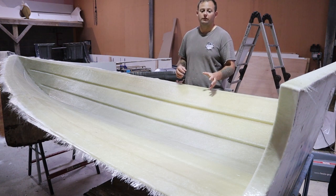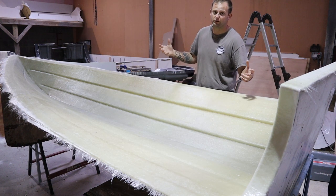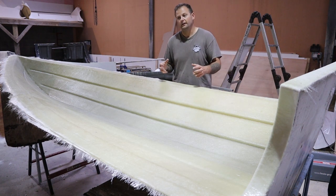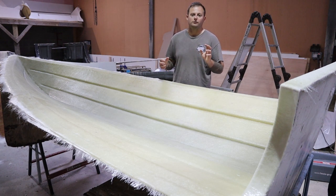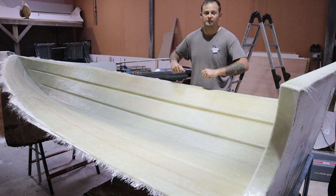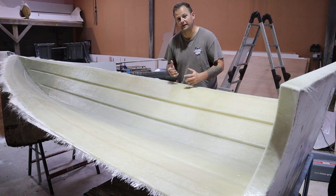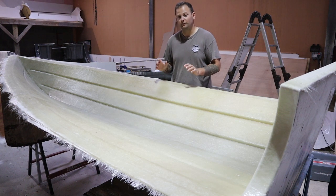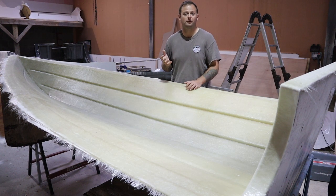Number three, the third option is these lightweight foam core boards. So you might see big green boards or people using those. Some people put them in their transom. Now, I'm old school in that sense, I do not like it. If I can squeeze it and I can snap it with my hands, then I do not want to be hanging an engine off the back of it. And I especially don't want to be hanging 200-400 horsepower off of that board. I'd rather stick with something that I know, which is ply or timber.